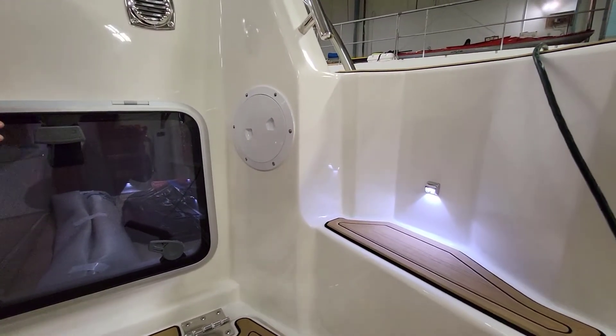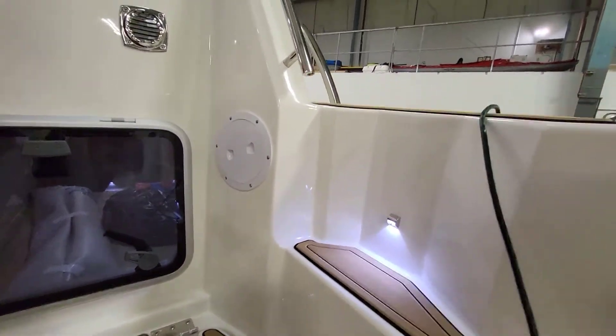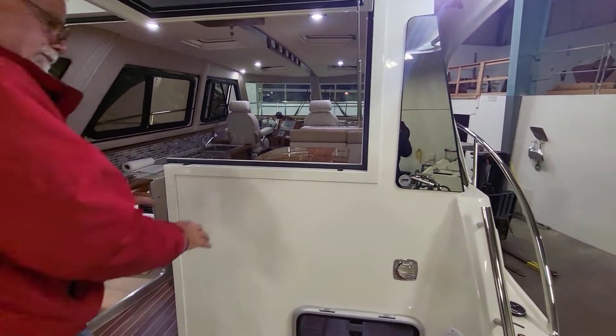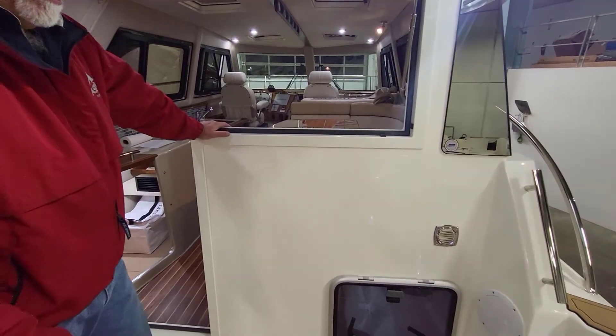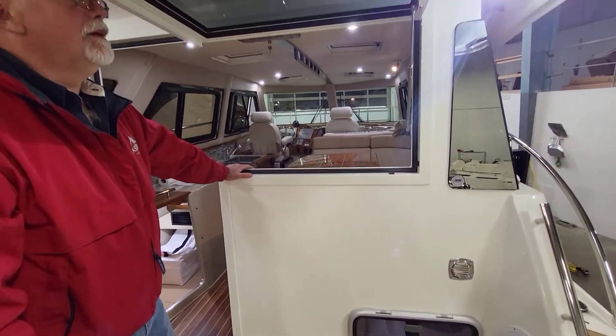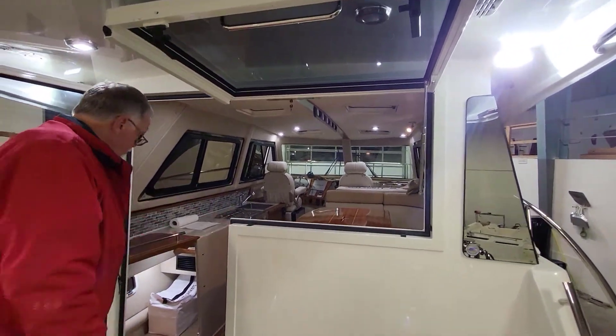Right here are the fuel filters for the three fuel tanks, all labeled beautifully. Everything is double hose-clamped, and all hoses are color-coded on both ends so you can service anything easily. Nice big stainless hardware, O-rings inside the hatches and latches. There's a hatch to get into the quarter berth and a pie-cut access panel for the wiring. Most people order a table here, but Mike needed the bigger deck for his fishing setup.